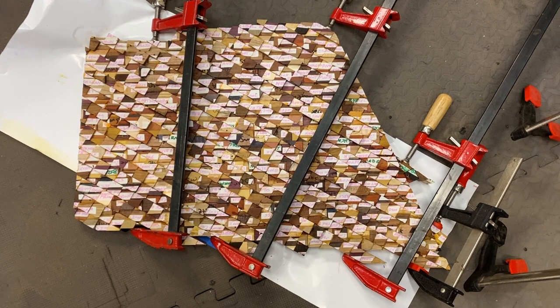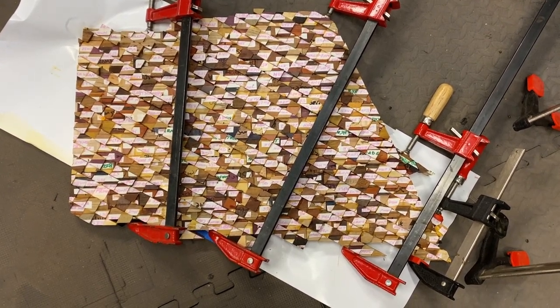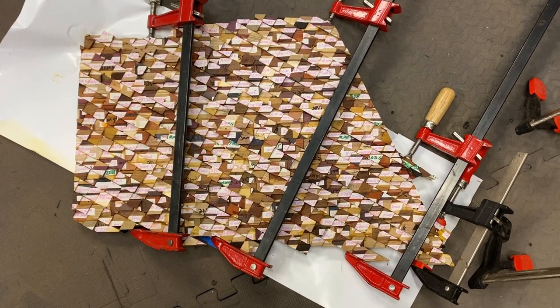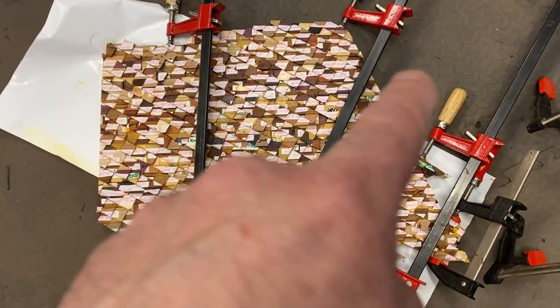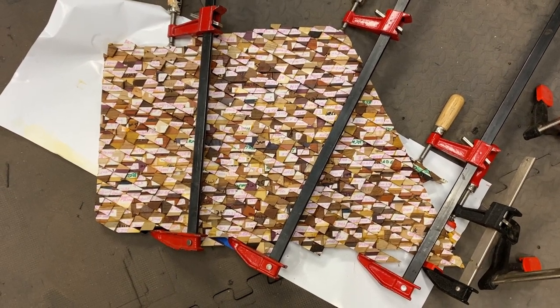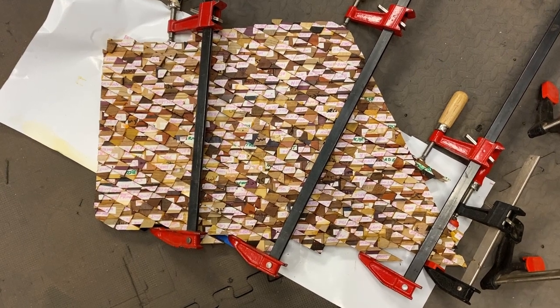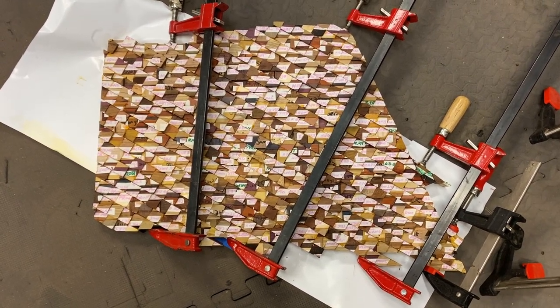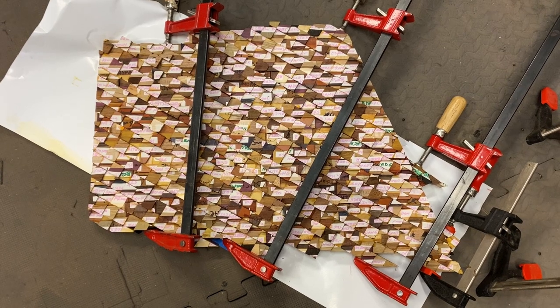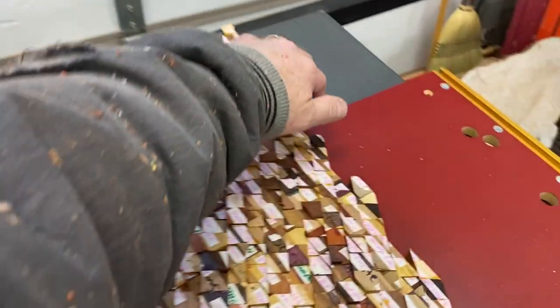Here is the completed blank. It's dried overnight, with 30-degree cuts in both directions. I'm ready now to cut segments off lengthwise with the grain, and then we'll take those to the bandsaw and cut them into 5-inch blanks. One night this upcoming week, we'll have a private meeting where we will draw for who gets which blank.